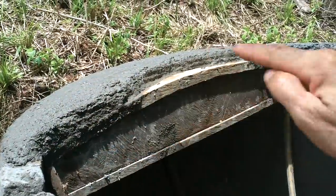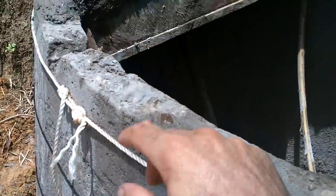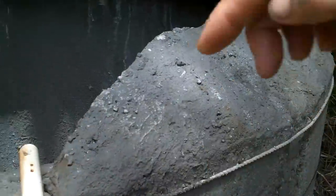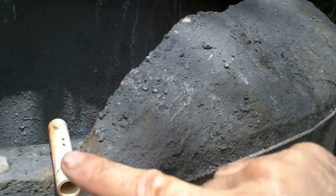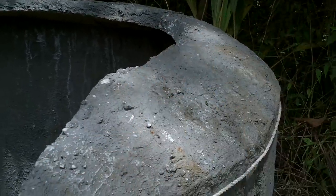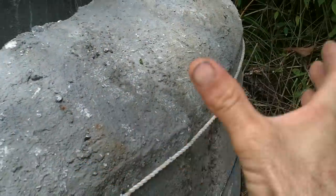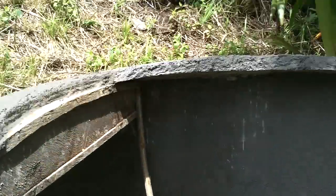For the most part this has a full arc going across, and as long as the ends are held from pushing out — that's why I've got this nice strong rope — it'll hold its shape. With the first piece, it was overhanging a lot, but it had this arc at the edge that kept it from collapsing in. Once the whole thing is in, to collapse inward it would have to push outward, so as long as the outside is contained it won't push out. Eggshells are so great — I love domes.